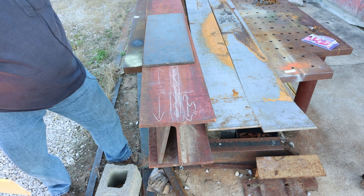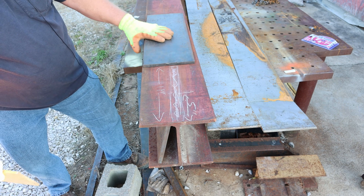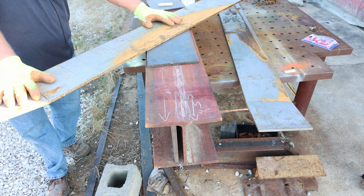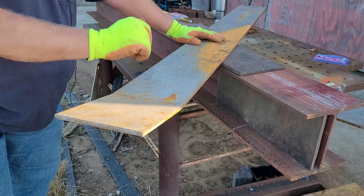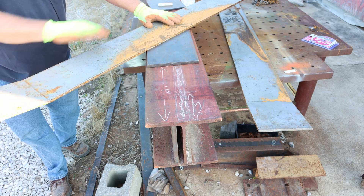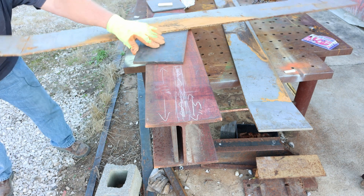The bottom is going to be capped with three-eighths. It's going to run 60, 68, 72 inches — whatever it needs to be — the length of this beam, to make this beam extremely stout. This is a Chris Wolf component. This little kick here is going to go towards the capped end of the cylinder, and the push rod end will be on the other. I'm going to spin this around real quick, hopefully not drop any steel on my toes.